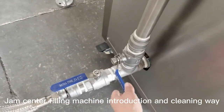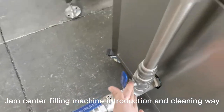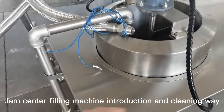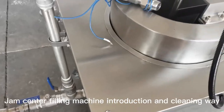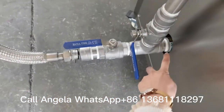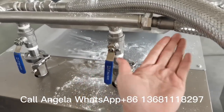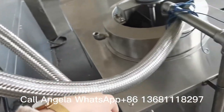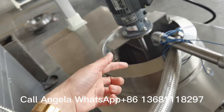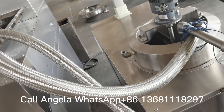Here is close, and here is go, here is up, this one is close. So this is also for cleaning — cleaning the pumps, cleaning the inside, the tank. So it's a circling cleaning. To clean these tubes, you can let this one close, this one close, so the jam will go through, and also here close. So the jam will go and come back. And also this is the circling cleaning — you can change the dirty water, change the jam water to the clean one. So it's a circling cleaning itself.